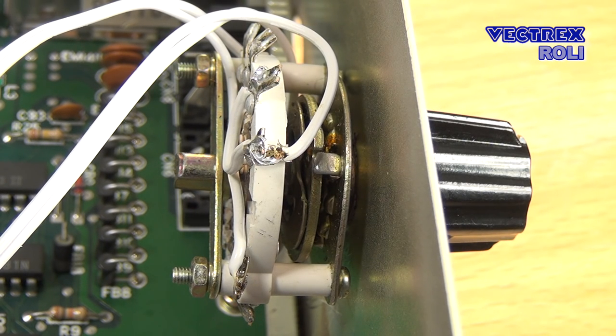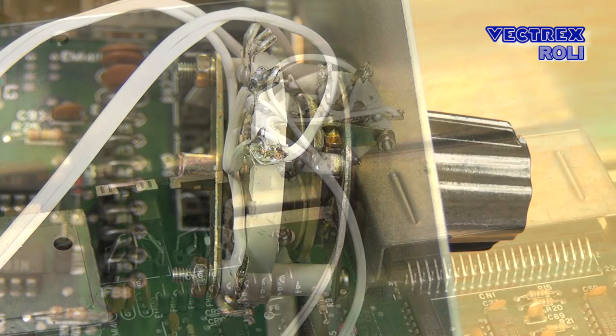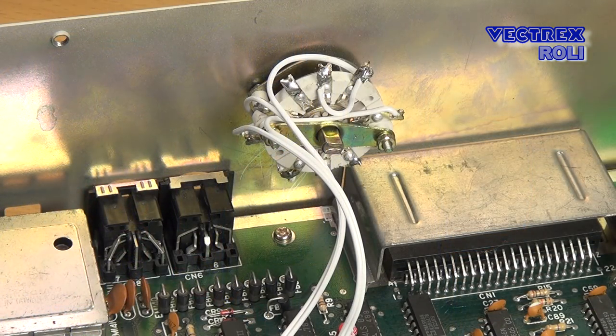Even if I want to use a modern drive replacement, I still want to be able to boot also from the internal 1571 disk drive using address 8 from time to time, so with my switch I can simply change the address of my built-in drive to addresses 8, 9, 10 or 11.